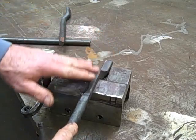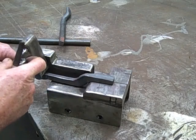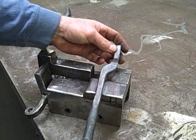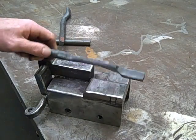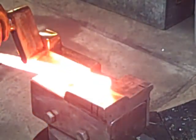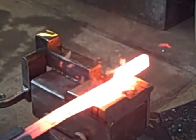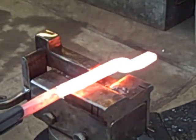I'm going to come over to this trough a little bit. I'm going to hammer down here and work it in this way. Come back over, work it in this way a little bit, bring it back to this point again, lower the arm, and clean this up, flatten everything out. If there's any heat left after that, we can draw this part of the reins out on this piece of steel right here. But the sequence moves pretty quickly, and it's very accurate since all the measurements are marked off on the jig itself. So we'll go to the hammer and do this in real time, and you'll see what I mean — it gives you a nice finished piece.